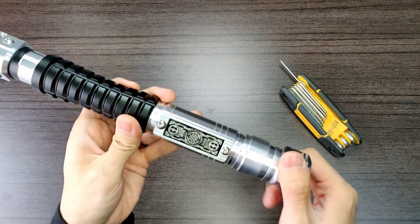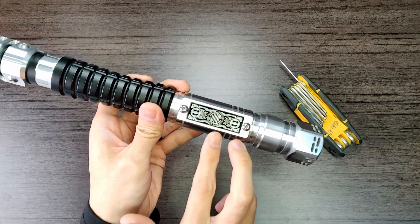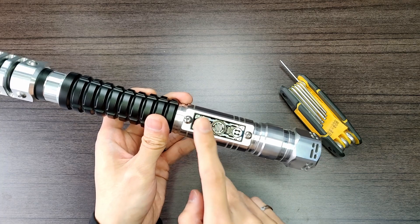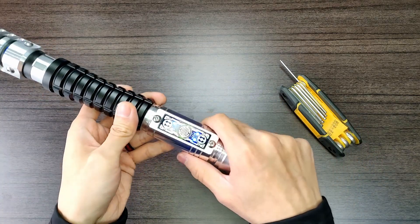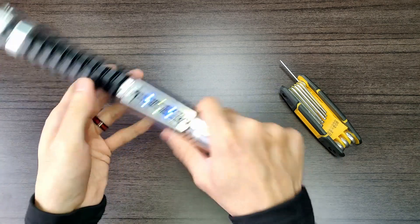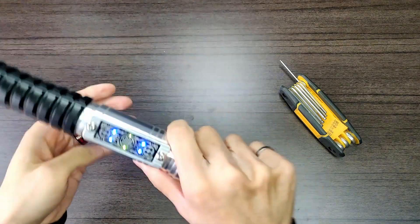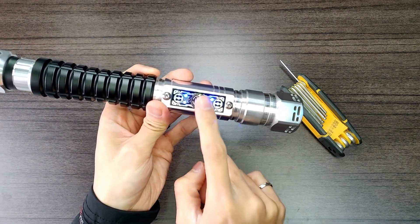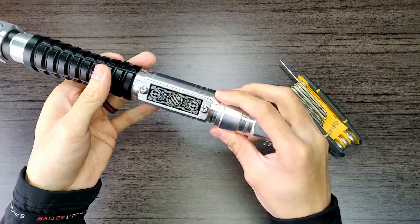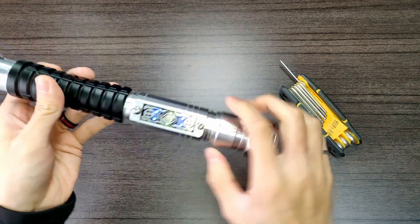The way this is wired is that there are actually three capacitive touch buttons. I wired up the top one as the main switch and the middle and the bottom one as auxiliary. In the config you can actually change this up however you want. So you have your blue LEDs, green, blue — got your illuminated Neopixel connector in there, and one of the two auxiliary buttons. I've configured it for twist off as well as swing on.